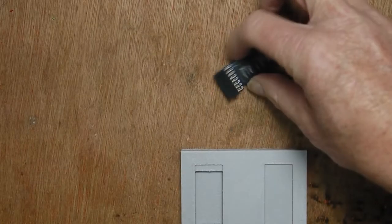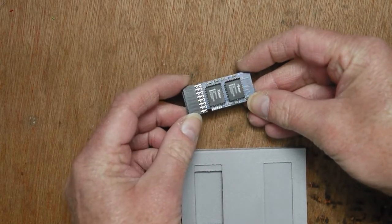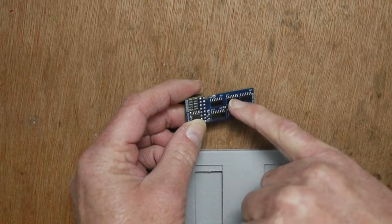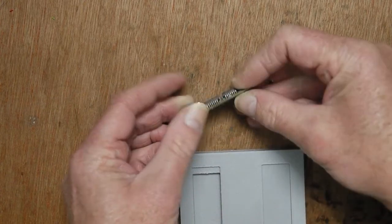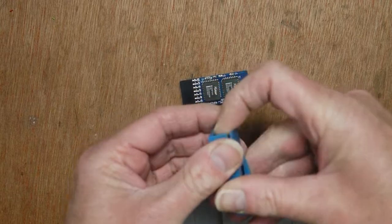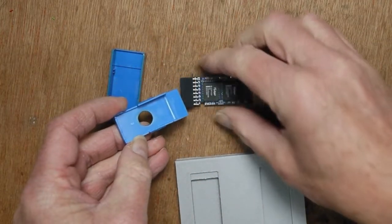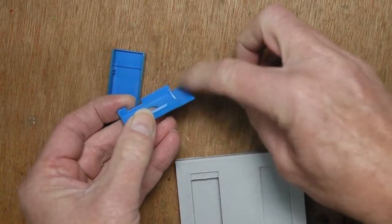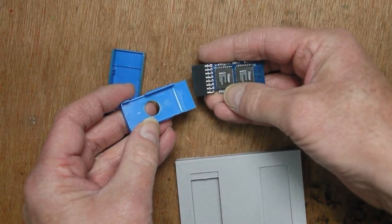This is the version 1.2 512K flashback, and had a few problems. There was a logic problem, so I actually have to, on these PCBs, solder a couple of pins together there. There's also mechanical issues, so in the case, I'll take that apart, you actually have to take the wall away here for the connector. That's just because of the connector that I've used, and also part of the walls here because of the wires coming out of the connector, top and bottom.